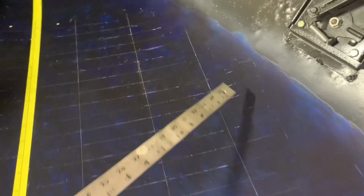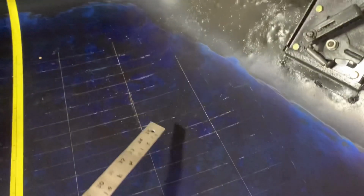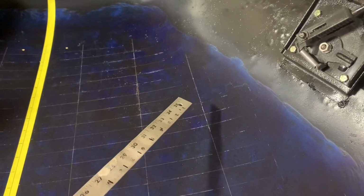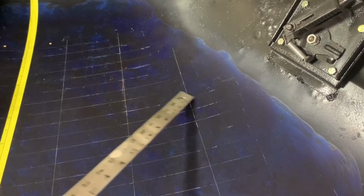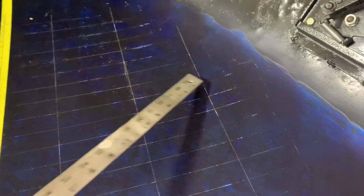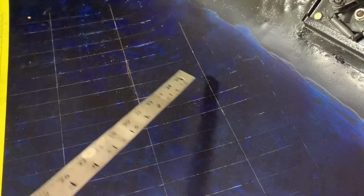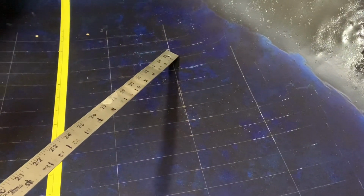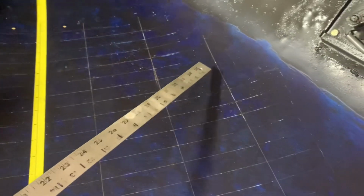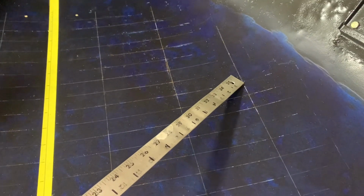And now I've got to determine how deep I want to get into the bend of the hood. You don't want to punch a straight louver that's flat too close to a curved surface. So now I need to determine how far I can carry these louvers. And this one right here, I'm not really that worried about. It's fairly flat and it gets a little curvy down here, but this one here gets kind of curvy right in here. So I'm going to have to stop back in here somewhere.